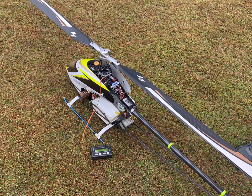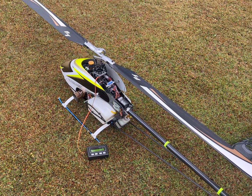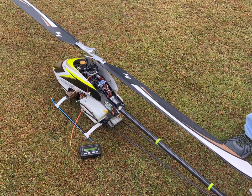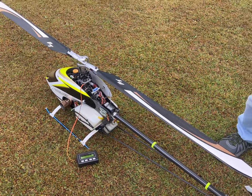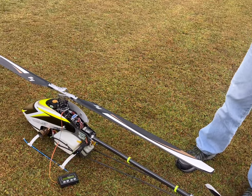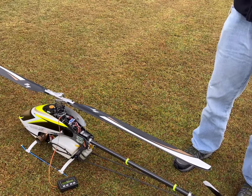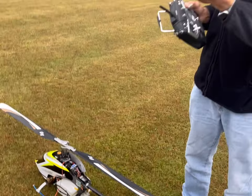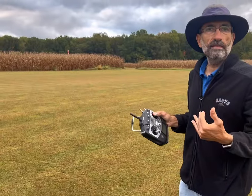So it wants the temperature to rise to 240 Celsius. Once it reaches 240 Celsius, it switches over from the kerosene fuel line to the main fuel line. It transitions between the two and then it ramps up. And then you get into ramp, and now your engine is actually running. The starter goes up to 50,000. Once it gets up to like 55,000, then it's considered running.